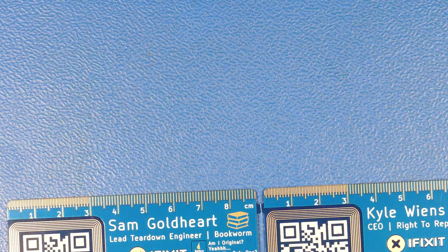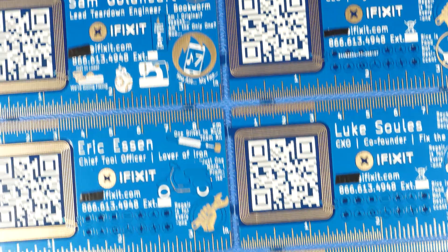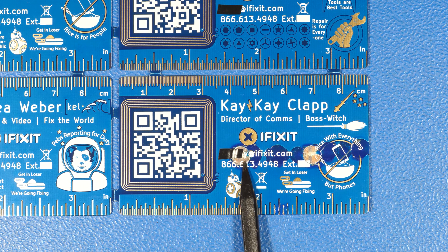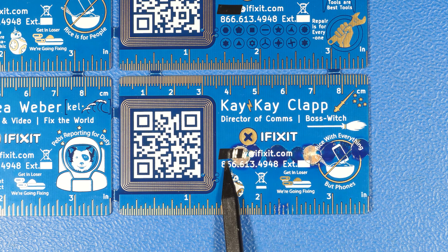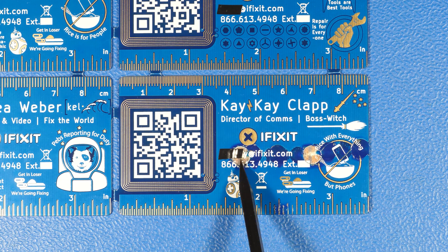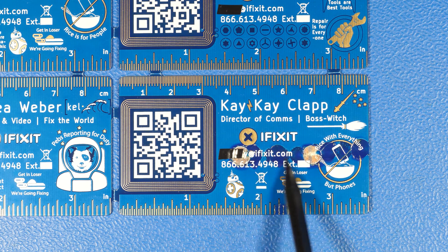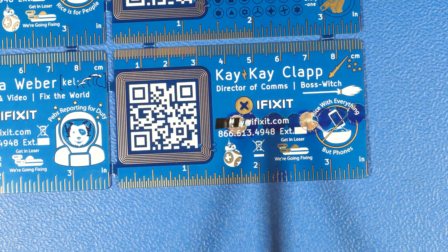But it was more than I was expecting. When you make a panel, there's usually a little note that comes up saying there's a certain percentage that are going to be defective, which is probably fine. But in this case, I wasn't expecting them to come out quite like this. It looks like there was contaminants during the solder mask process, or one of the processes, and it was pulled along with the card. You can see the prepreg layer right there showing up, and it looks like the solder mask wasn't actually applied evenly, so it created this whole issue right here.